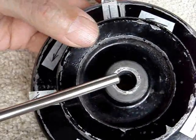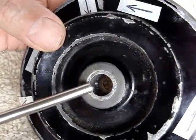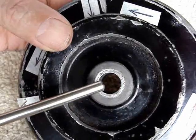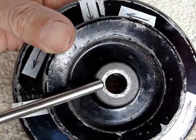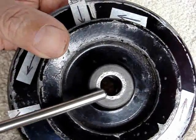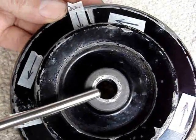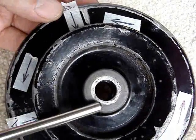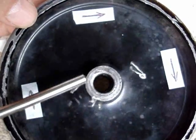You've got to tell me what the taper angle is, or tell me what the taper is and I'll figure out the angle. Is it a taper pin reamer taper? Is it a metric taper? Is it a Jarno taper? Some other taper? It could be a Brown and Sharp taper. It definitely isn't a Morse taper, and I don't think it's a Brown and Sharp taper because a Brown and Sharp is pretty close to this taper. It's what I call a difficult taper.